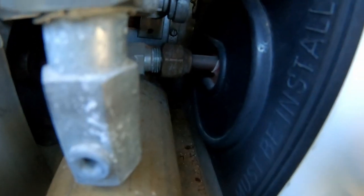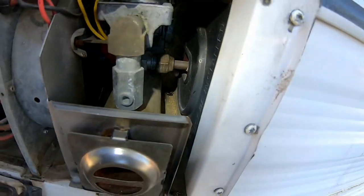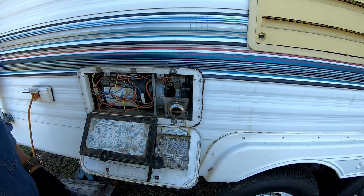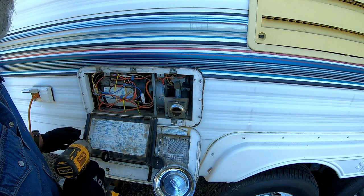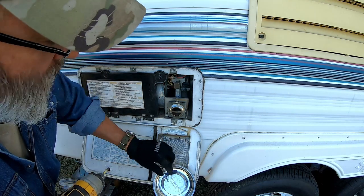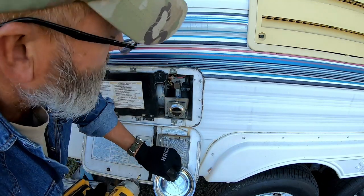There's the gas line. You can see it comes out. Actually, looks like it runs underneath the refrigerator. But it's buried pretty far back in there. Okay, that's loose. Now I'm gonna pull all of these square drive screws out. And there's gonna be butyl tape behind this thing as a water seal, so I'll more than likely have to replace that when I get this off of here.